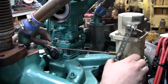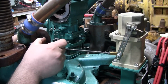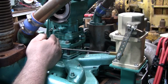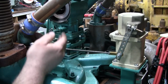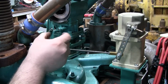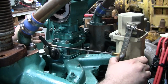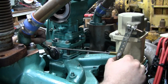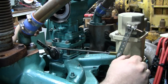And what I mean by that is, for a certain change in the throttle position, degrees of rotation, let's say from 10 to 20 degrees of rotation, you get a certain horsepower increase. Well, between 80 and 90% of rotation, you get a different amount of horsepower increase or change. So it's kind of hard to describe. There's some good publications online about the geometry of a throttle butterfly, and flow rates, mass flow rates. It's kind of complicated.